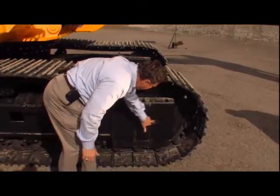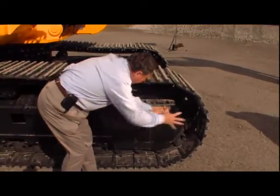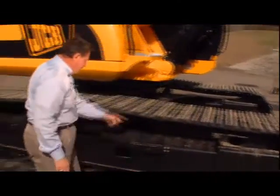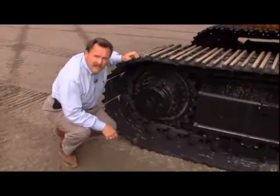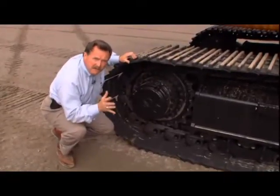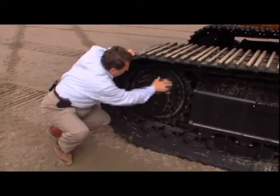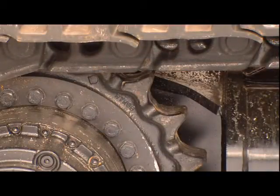You can see as it moves backward, you're going to wear out a little bit faster, but you can keep your tracks tensioned — so that's going to show the wear there. A small thing to point out, but it is important. Small details count. Sprocket assembly here with scallops so the material can fall out — it doesn't build up, it won't wear out prematurely.